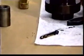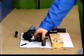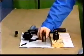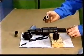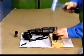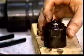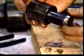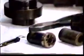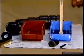Immerse the nozzle in lubrication oil. Heat the oil to 150 to 200 degrees centigrade, and normally the needle can be removed. If there is coke between the nozzle and the nut, it may be difficult to remove the nozzle. In such cases, place the nozzle with the nut, and without the needle if possible, on a soft support and knock it out by using a piece of pipe. Never knock directly on the nozzle tip.